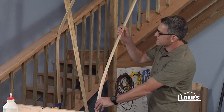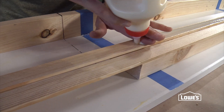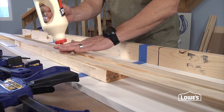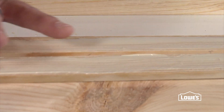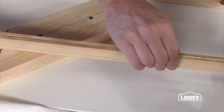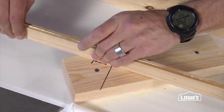To bend wood with a jig like this we need to use thin flexible wood. I'm going to apply glue to both of these pieces and sandwich them together, or laminate them. When doing a laminating project like this, it's important to use a lot of glue because it becomes the structure of the leg. We want to apply these two pieces together and squeeze them so the glue bonds and kind of sets.